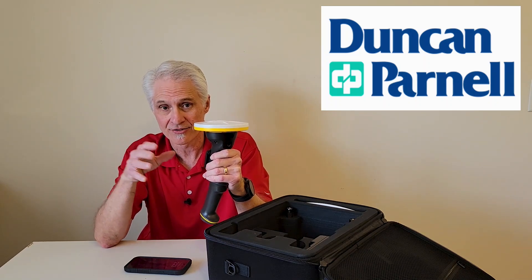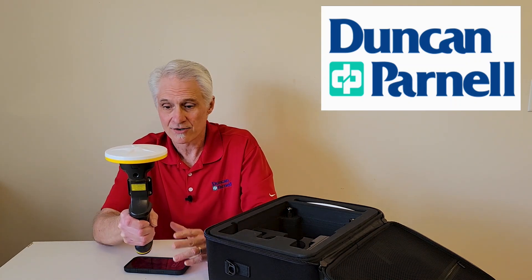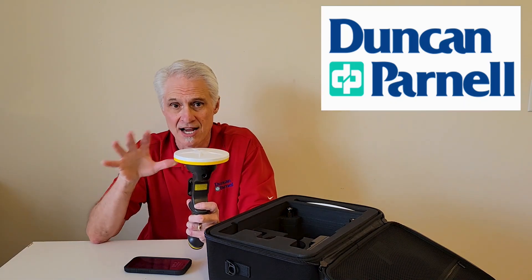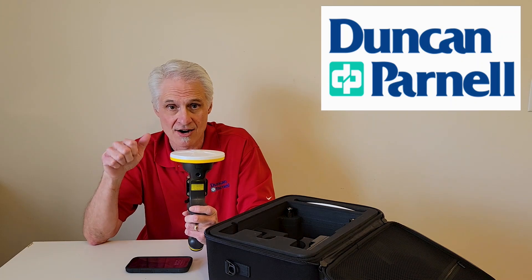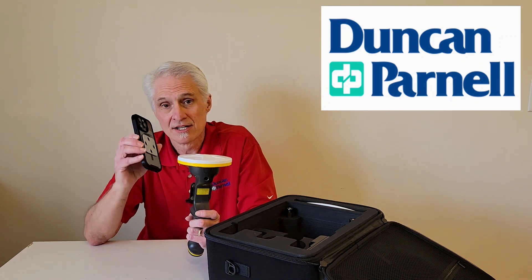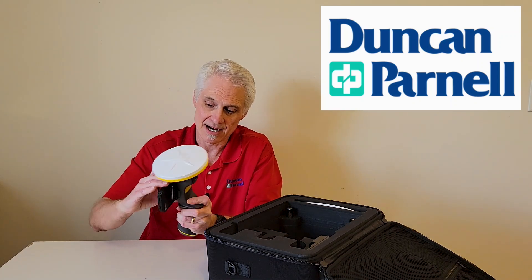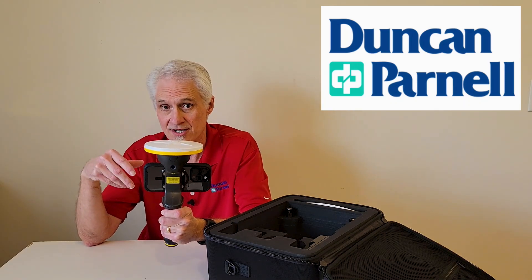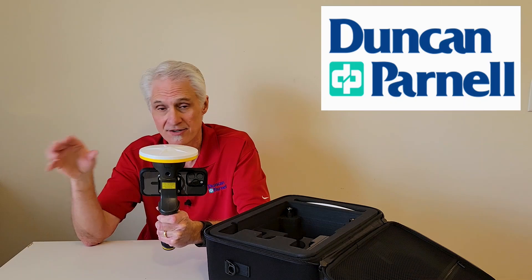The inspector can go out using the GPS to geo-reference that model, see where they are on the job site, and make sure that what is being built actually matches the model — that's the augmented reality. SiteVision also has tools that allow you to measure areas, get cut and fills to surfaces, measure slopes. And if you're using an iPhone, you can also do some 3D scanning. You can perform checks along the way, or you can just take the unit out there and capture topo data or as-built data.